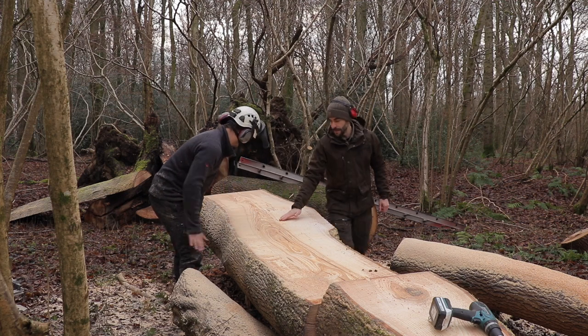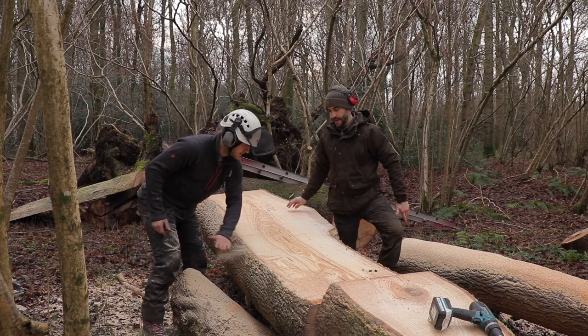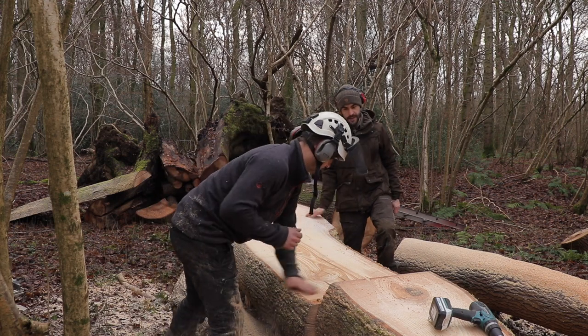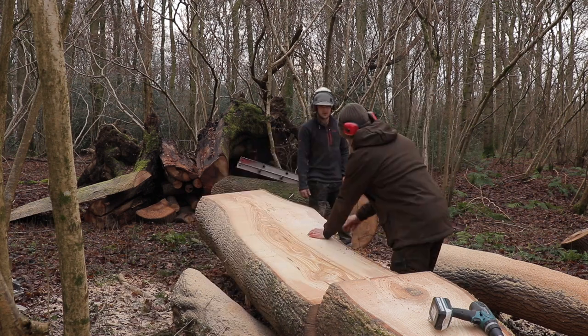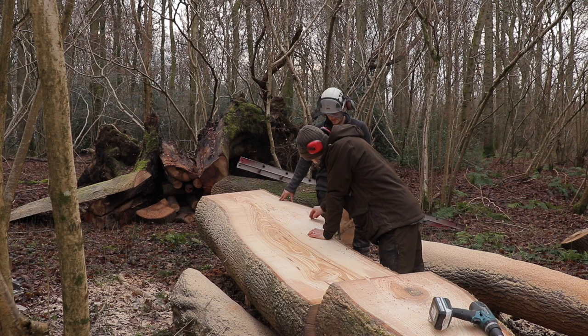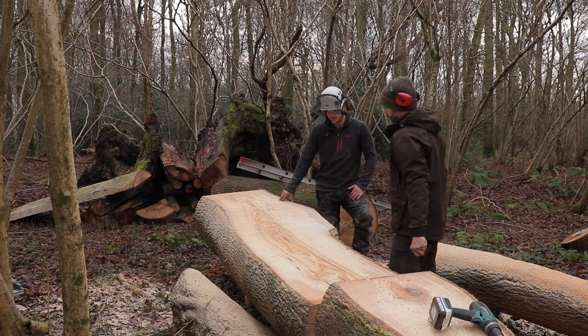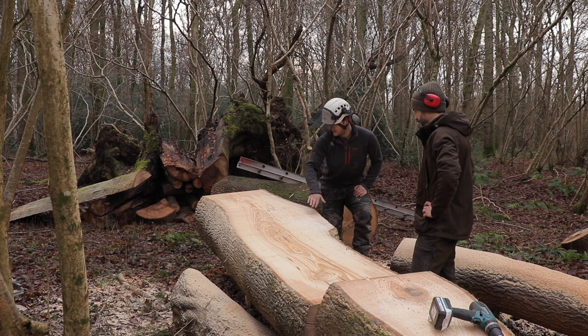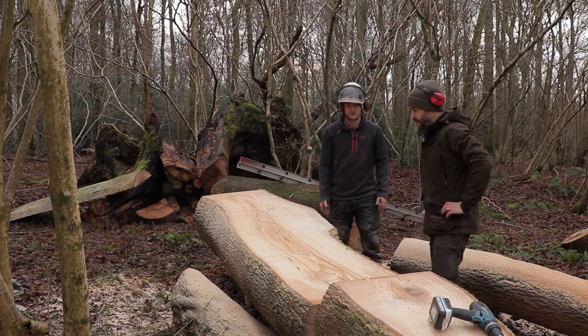There's the moisture in that middle where it's wet there. It's a lovely grain in there — almost like quarter-sawn between the edges. Changes towards the knots where the branch is coming out, like contour lines on a map. Once we get a bit lower down and into this bit, you'll see the interjection of where it comes in. Ryan discussed how the planks would be about an inch thick, and although they'll shrink a little bit, it'll be more inwards rather than in thickness — some will cup a little bit and stuff.